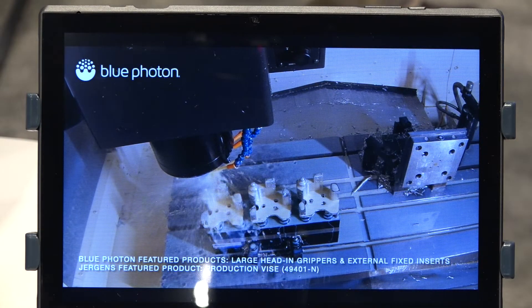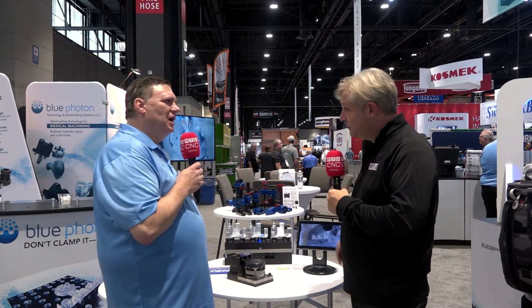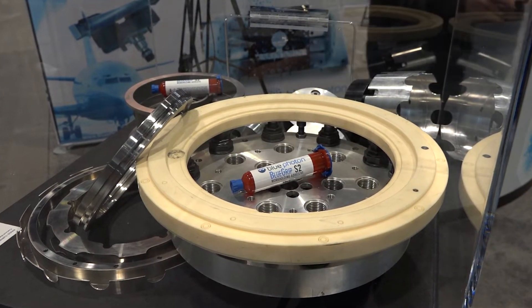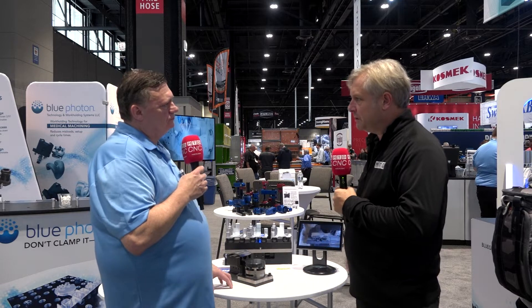That's one of the solutions — milled parts — but what about turned parts? Thinking of something like a ceramic part, which is relatively tricky to machine. Ceramics are very brittle and hard to hold on to, so customers typically use wax or vacuum. With our workholding system and blue grip adhesive, we hold ceramic parts without damaging them but firm enough to grind. Holding with wax you're not going to get that clamping force, plus wax is very difficult to work with — it takes a long time to set up and to remove.